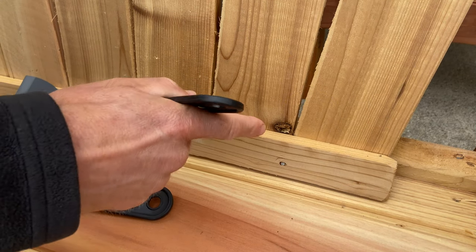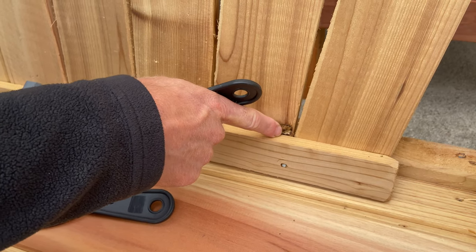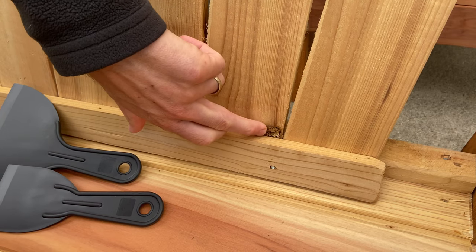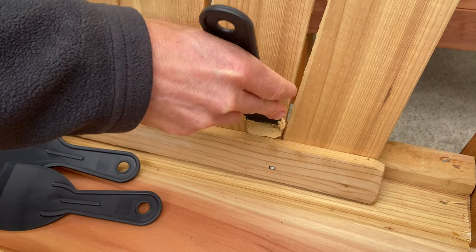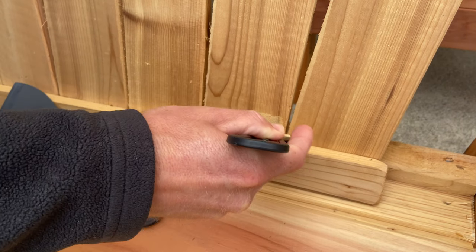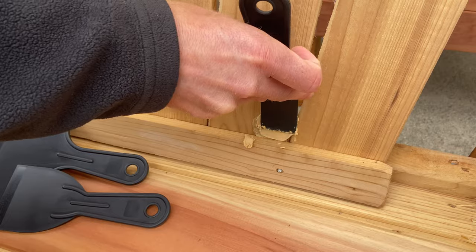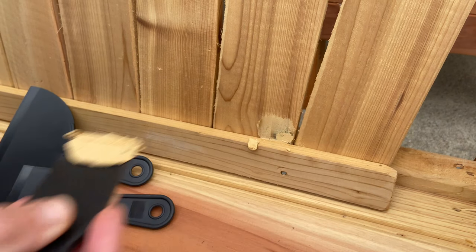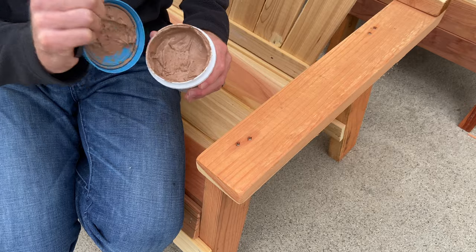The recommended best practice is to cover the area so the filler is actually above the wood surface itself. This allows it to harden inside the hole, then you sand it off — eliminating the risk of under-filling and leaving cupping. You can also apply wood filler to knots. You probably wouldn't fill a knot without a deep gouge or missing wood, but here we can see this knot is missing part of the wood with a hole. If you want to fill that in, wood filler works well there too — same practice, working the filler all the way into the depth of the hole.